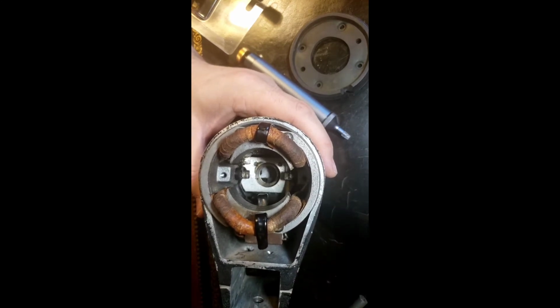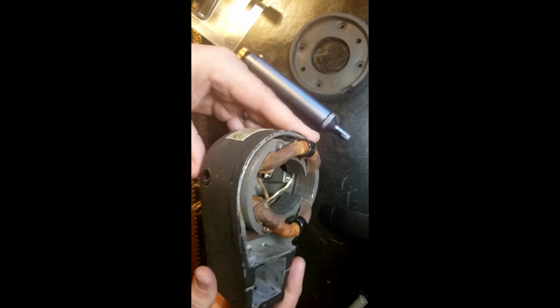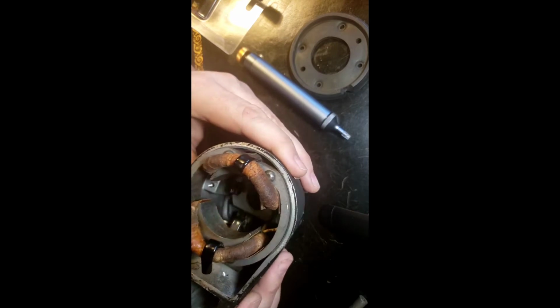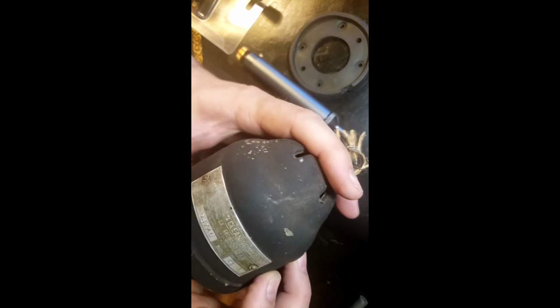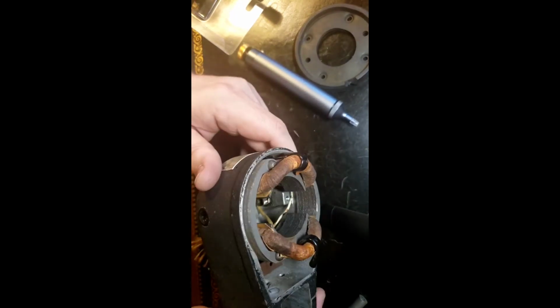Sorry, I know this is really kind of a weird video, but you kind of have to already know how one of these watch cleaning machines works to know what the heck I'm talking about. But yeah, so I was looking at all different ways to modify a regular L&R Master to do the reciprocating or oscillating, however you want to call it, motion on the basket, and I'm thinking that somebody has already done that by taking this head, which again, if you look here, model MA, the ones I've seen like that were on a Mastermatic. So I don't really know. But there's clearly more to this than just a one-way motor. So I'm going to continue to take it apart and see what's up.